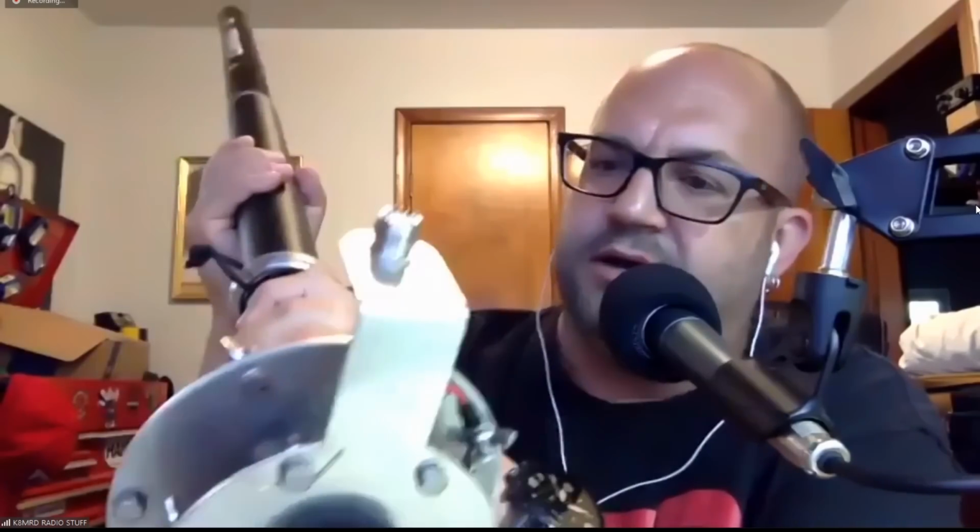So the idea behind this, I don't really guy my antennas high up. I guy them at about eye level, and I prefer to guy them lower because this can still kick out from underneath. So if you guy it here, it won't have the ability to kick out from underneath. So this is the only variable that changed other than the soil, but I can't imagine it was the soil because my other Expedition was fantastic. So I'm thinking that affected the resonance somehow. Plus I had three stakes in the ground next to the counterpoise wires, I forget if they were plastic or metal. So that's the only thing that changed with this Classic antenna.